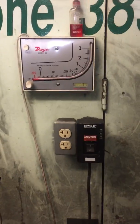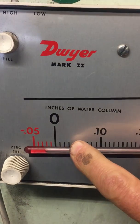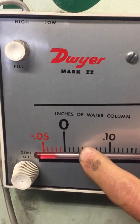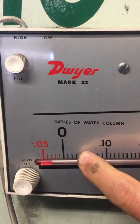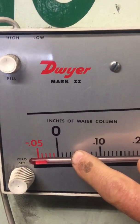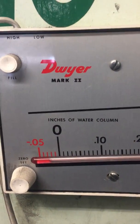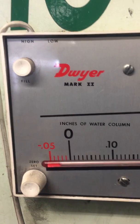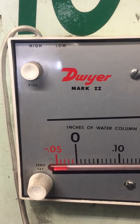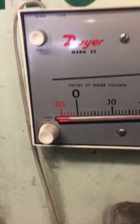That's why the manometers are very, very important. We always want to have it at a negative inches of water column, never positive. A positive water column would be on this side of zero, and you never want that, because what that indicates is the inside of your stove is under pressure, pushing gases out into your house. One of those gases is carbon monoxide, which is toxic and can kill you. You always want to be on the red side of the zero, preferably between the second and third point on a mechanical draft.